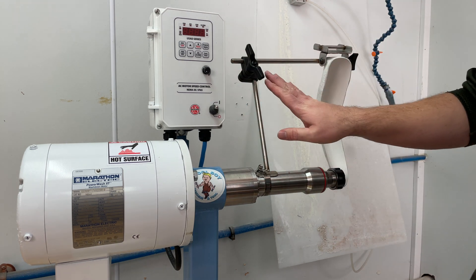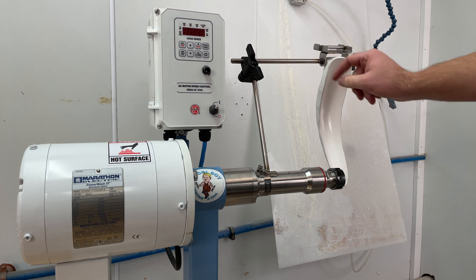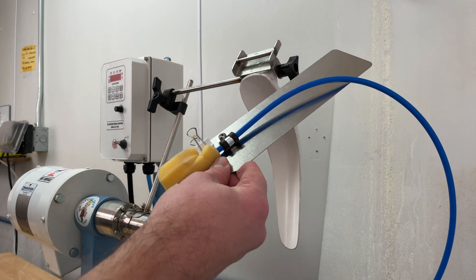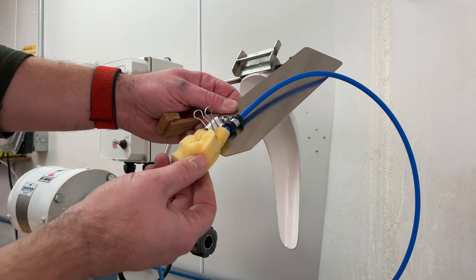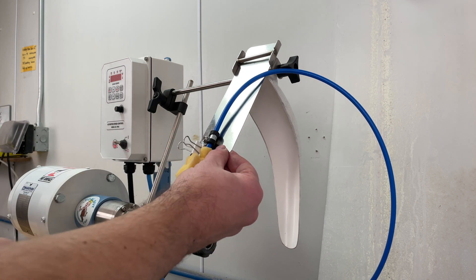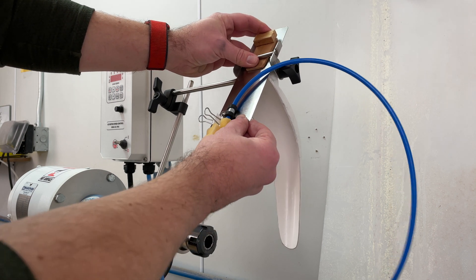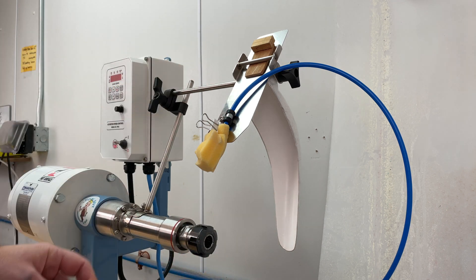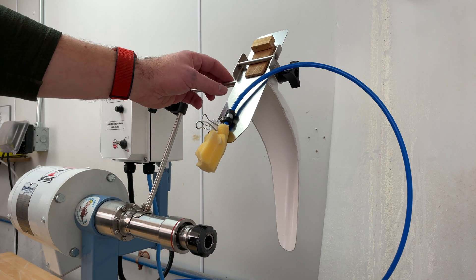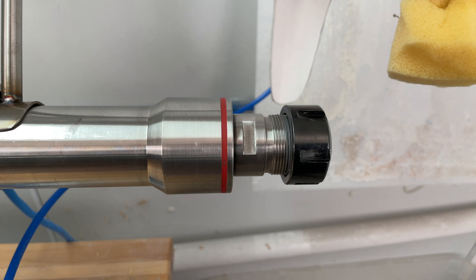This can all be adjusted later — whether you need to move it back or in and out, it's very easy. Once you tighten it down, it tightens the attachment on both shafts. With your water system, this piece attaches to the water assembly we mounted to the base earlier. It comes pre-mounted with a sponge; your water will come out onto the sponge, which contacts your wheel as you're grinding. Slide this piece through the bar and use the little wooden piece to tighten down where you want your water feed, giving you versatility for different wheel sizes and work areas.